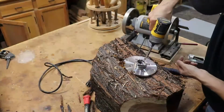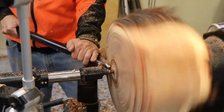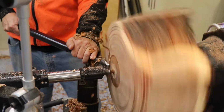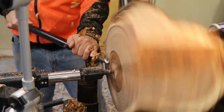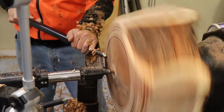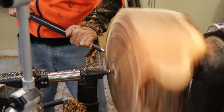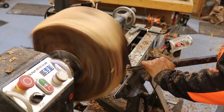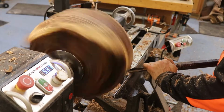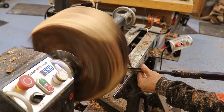3 horsepower lathe. Here I'm mounting a good size faceplate onto the blank, which really helps stabilize it for the turning operations. Then I start by facing it off, just to get things round. After I get that side flattened, I'll work on the other side, removing enough material to get it balanced out in the lathe so I can start spinning a little bit faster. It's slow going initially with this way out of round chunk of wood.